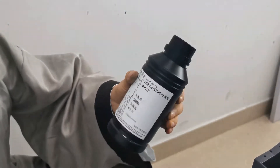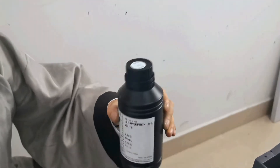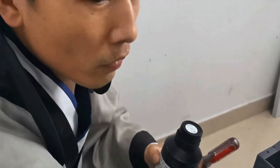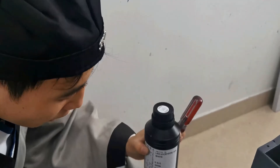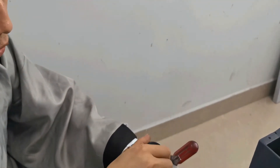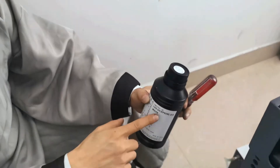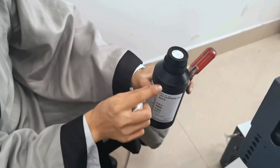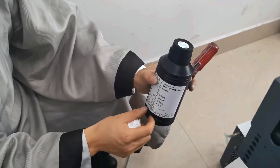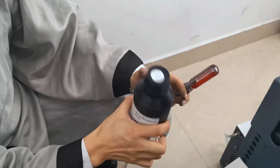For the white ink — this is the white ink — after we check it, it's not enough mixed. We still need to load it, because the ink during delivery is for a long time, more than 10 to 20 days. So the white ink is settling: the top is light and the bottom is heavy. It's not equal. So you check it, making it equal.